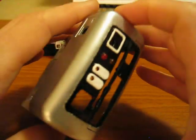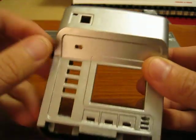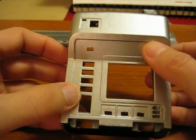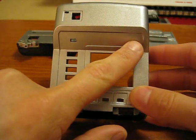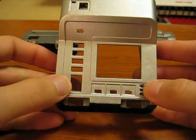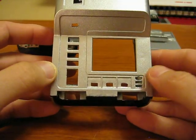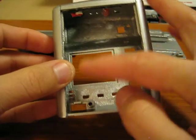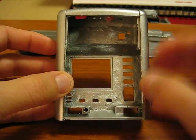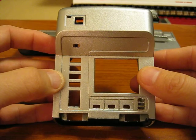After that, the next step will be to install the graphic up here and then the circuit board underneath inside. The graphics are already cut — I'll show you in the next video. They fit perfectly here, absolutely no problem. The challenge will be to line the lights up perfectly with the graphic that goes on the main screen here. Then it'll be installing all those graphics, making sure they line up perfectly, securing them with hot glue, and installing the reed switch around here so that when you open up this bad boy, everything will turn on — sounds and everything.